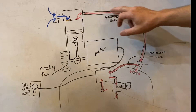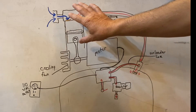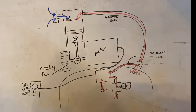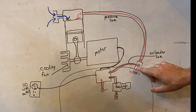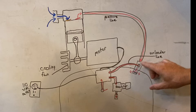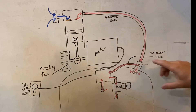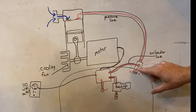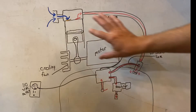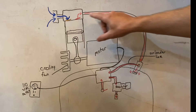Pressure out is going to go through this check valve. The check valve's purpose is to keep the air in the tank and not bleed back through the actual pump. If that check valve goes bad you will be adding extra load to your motor because there will be extra resistance against the top of the piston. An easy check is to take the air line off the top of this check valve when there is air in the tank and make sure you don't have air bleeding back. If you have air bleeding back through this line when the compressor is shut off, that check valve is bad. If you decide to do this, make sure you take that line off slowly so you can hear the air pressure bleed off, because that line will be under pressure if the check valve is bad or the unloader is not working properly.